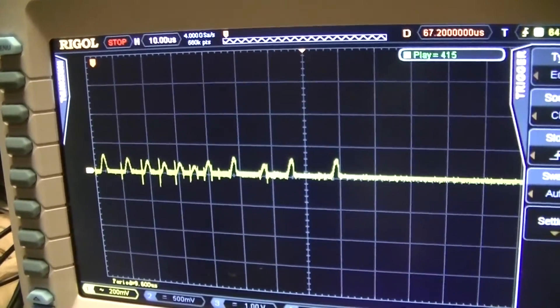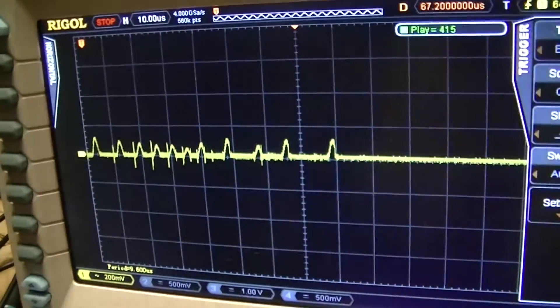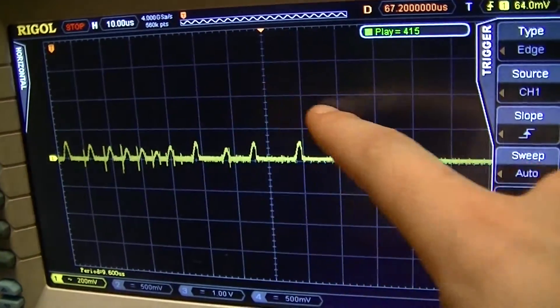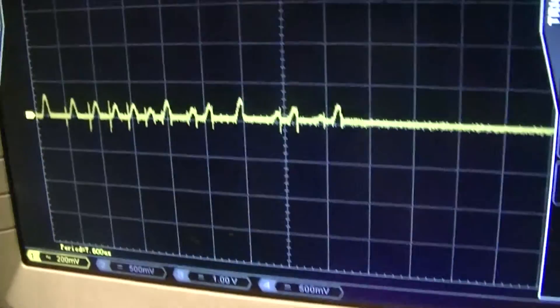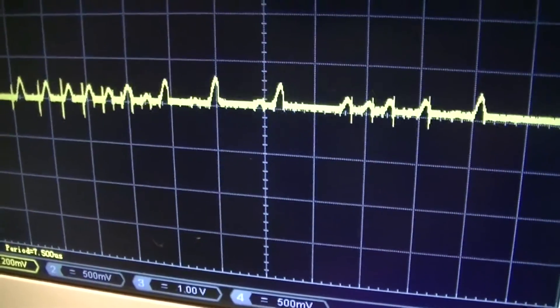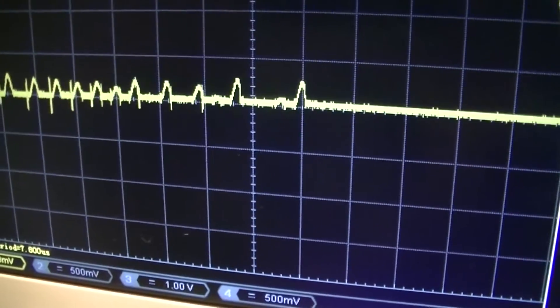Every couple milliseconds. So it appears that this oscillator oscillates until it hits some threshold, then there's just a steady decline, and then the oscillator starts up again when it hits some other threshold. So again, yeah, a really crude nasty power supply, which is pretty much what I expected.